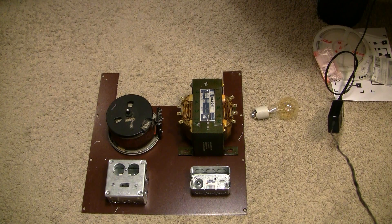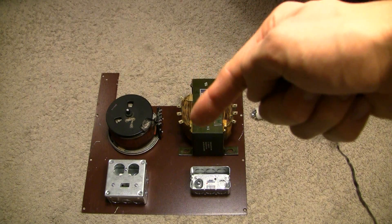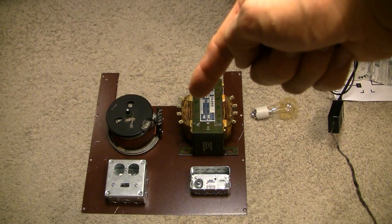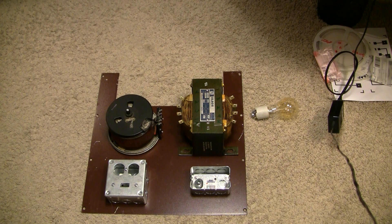This will give me about 500 milliamps of current on the 240-volt side, and about 1 ampere on the 120-volt side. I can get up to 480 volts out of this transformer because there are two 240-volt windings, and on the other side two 120-volt windings. The Variac runs into one 120-volt winding, and the other winding provides an isolated 120-volt source. I don't suggest building this open-frame — build it in a completely sealed, safety-grounded enclosure with no exposed wires. You're also building this at your own risk.